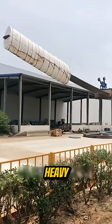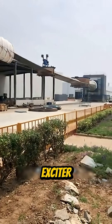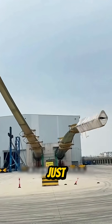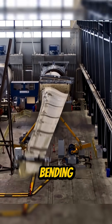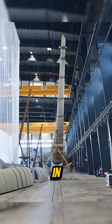First, a heavy weight is attached to the blade. Then, an exciter shakes the entire blade at its natural vibration frequency. With just a tiny amount of force, the blade swings in massive arcs, bending, flexing, and twisting, exactly like it would in strong winds.